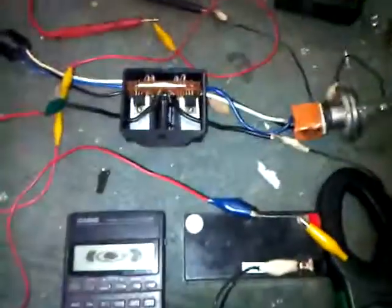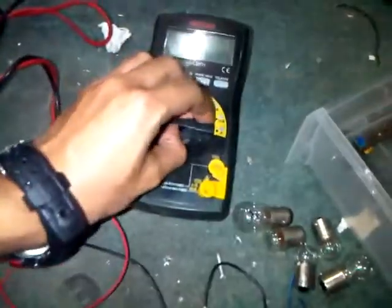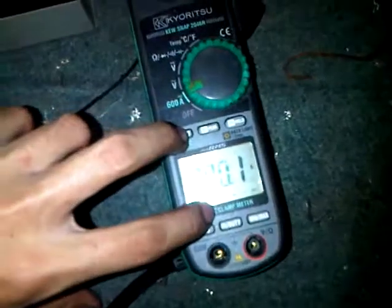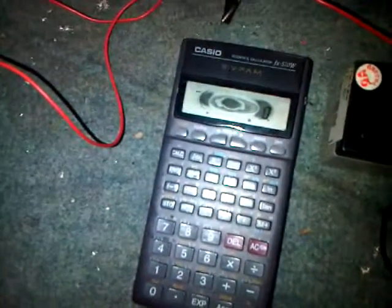For this video I'm going to measure the performance of this unit by measuring how much heat it produces. I'll do that by first measuring the voltage drop across the MOSFET. Currently it is at 12.7V because it is in cut-off mode, so no current is flowing. This meter will measure the current and I'll set it to DC, then calculate the power it produces in watts.